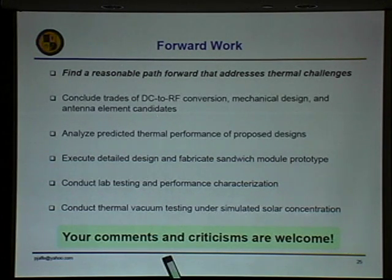Have you considered these heat sink technologies? You know, they're very lightweight. We've looked at a number of novel heat transfer mechanisms. One of the areas of research we have at the lab is these diamond substrates, which are very good at heat spreading. We've looked at pyrolytic graphite, which has been around for quite some time. And depending on how crazy you want to get, there are these sheet flow radiators, which are tremendously efficient, but would probably be very challenging to apply to this kind of configuration. There are microchannel heat spreaders as well. So we have been looking at those, but in general, most of those are for moving the heat around rather than the actual heat rejection, which you would have to do at some point.